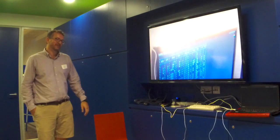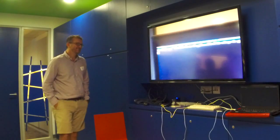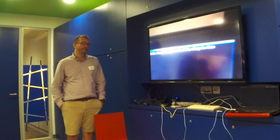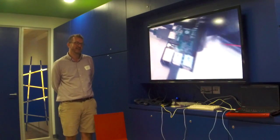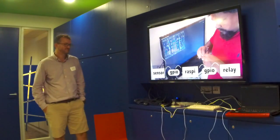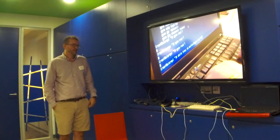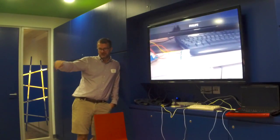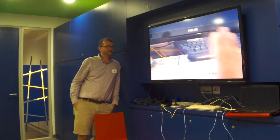Stefan came around and we were just messing around with it. Stefan from Paper. He works with Paper. And I think not many people know it's quite simple to do something with hardware. That's my relay. I need some more. I want to control everything in my house really through my Raspberry Pi. So I'm not using any crazy tool chains. I'm just using the all-powerful shell language, using a GPIO binary from the Wiring Pi package or something like that.